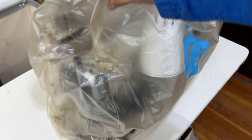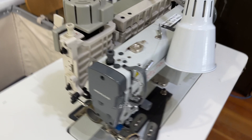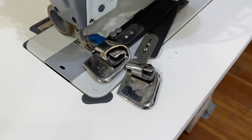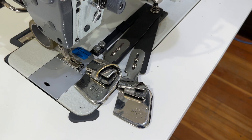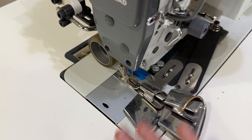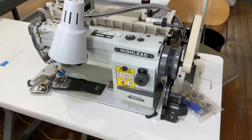Let's go over to this one here. This is a hemming machine — well, we're using it for hemming. It's got a puller system so it'll pull your workpiece along, and this one is needle feed so it doesn't have a walking foot. We had these custom folding attachments made by Tennessee Sewing Attachment to do two different types of rolled hems. It's kind of like a Swiss Army knife where you can slide this one out of the way, put that one up there, or if you just needed to do some straight sewing you could move both of them out. This machine gets a lot of use when we're doing our hemming.